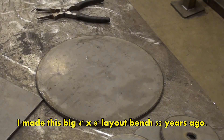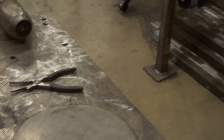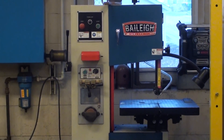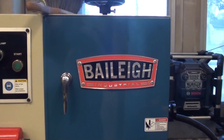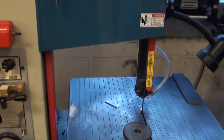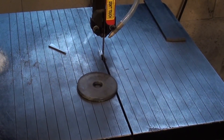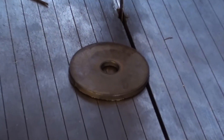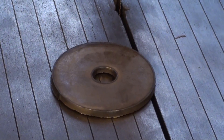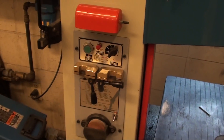I'll make the Lazy Susan a separate project later on — several people asked about that. Now, this all could have been done on a bandsaw, but it would take forever. Here at the high school they have a Bailey bandsaw, and these could have been cut on a bandsaw with a narrow enough blade. But I believe that's a half-inch blade on there, so it's a real fight to cut small circles on a bandsaw without making relief cuts or having a very narrow blade.